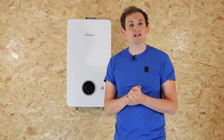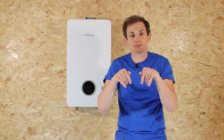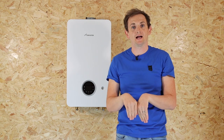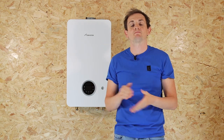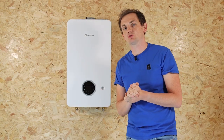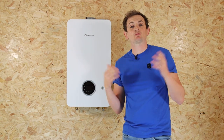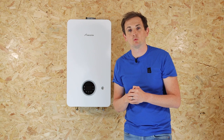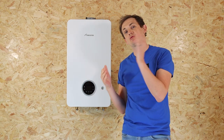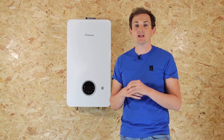Things we don't like about this boiler: first, there's no rear frame available, so if the pipes for your boiler drop from the top there's no frame to stand the boiler off the wall — the pipes have to go around the boiler. Unlike the range-topping 8000 model, it's only available in white and not black. The warranty also isn't that competitive for a Worcester product, although it is a lot cheaper to buy.